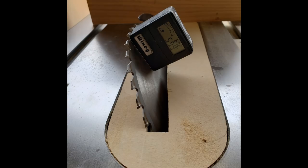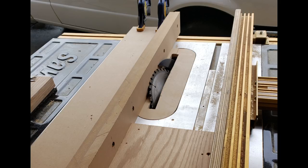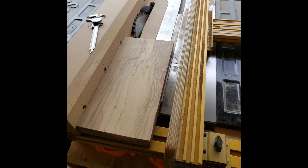The next key is cutting at the correct angle. We need 120 degrees for a three stave project. First, subtract 90 degrees because a table saw is already oriented to 90 degrees — that leaves 30 degrees. A magnetic electronic finder does a great job. I also made a new insert for the blade. Since my blade tilts to the left, I made an auxiliary rip fence that I can set and clamp to the table saw. The first cut removes the waste portion that cannot be used, at least in this project.